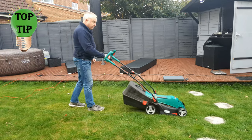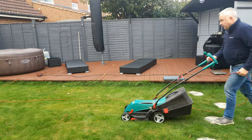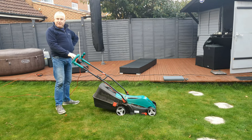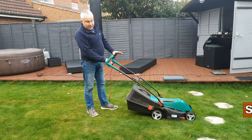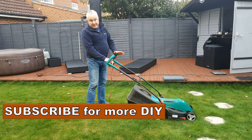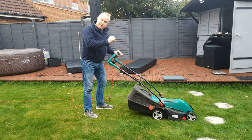Try and avoid constantly stopping and starting the motor, particularly at the end of a straight run across your garden — unless of course your garden is about 10 acres. Something I know from my work with motors in the automotive industry — motors for door latches, central locking, window regulators and seats — is that the lifetime of a motor can be very much dictated by the number of times that the motor is started.